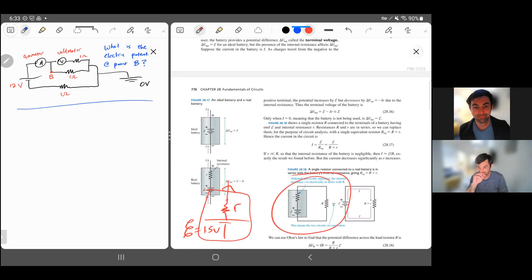In an actual circuit, if you took a real physical battery with some internal resistance and hooked a resistor across it, you can discover the effects. Plug in a couple different resistors, measure the current, and you can start to infer the internal resistance. Generally, batteries go bad not because the EMF drops a lot — your 1.5 V battery might read 1.35 V when it's bad — but because the internal resistance increases quite a bit, making it unusable.